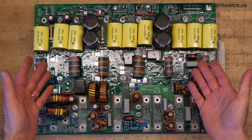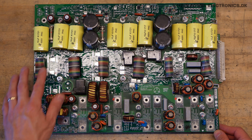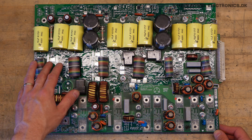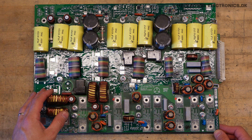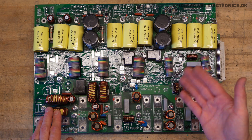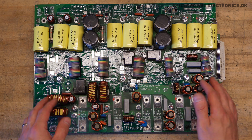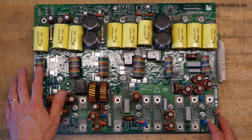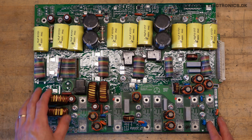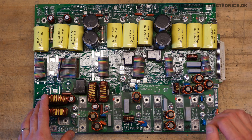The first striking thing is the nice large yellow EMC filtering capacitors — MKP type, 600 volt, 10 uF. Reusable for all your power electronics work, just go straight off the board. Other than that we have some electrolytics, most likely worn out, and a lot of magnetic parts, then mostly SMD around the colored ribbons for the gate drive. Some components over here look more like data acquisition.